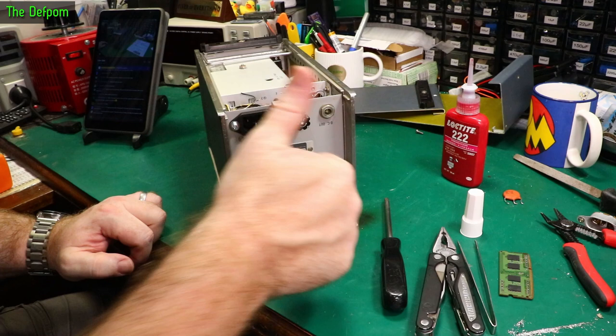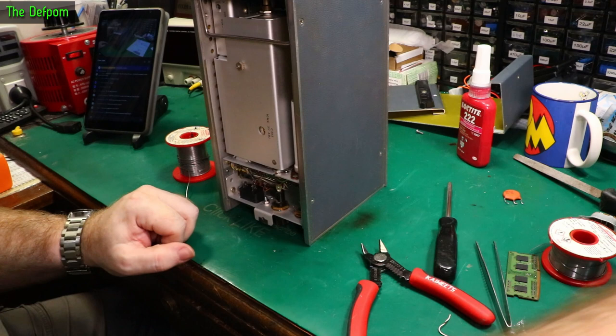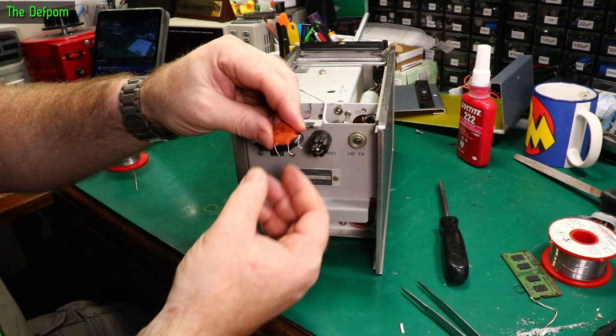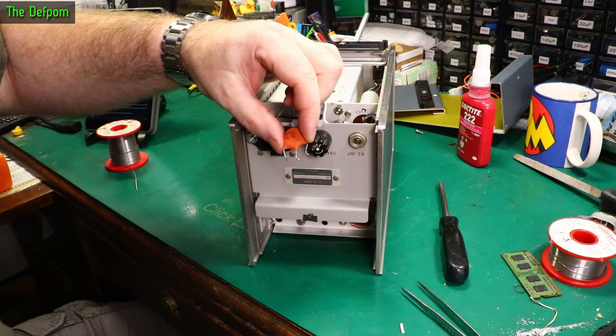I'm going to replace this wire that comes from the fuse holder here, just because I don't like it. It feels a bit weak at the bottom when I'm moving it around — so we'll put a new wire across here. I've also got to put this capacitor on the back of this connector before I put solder on it — mustn't forget to do that. I'm going to reuse this original capacitor because during my live stream chat they said to use the original one, keep it original. This is a ceramic cap and it's designed for this function. It's old but it's probably still fine — I did do a test on it and it seemed okay, so I'm just going to put it back in.